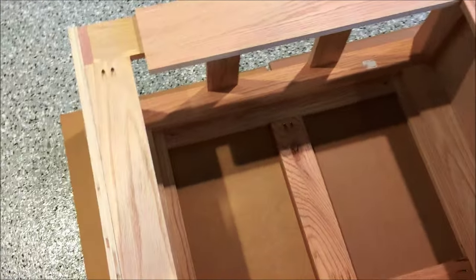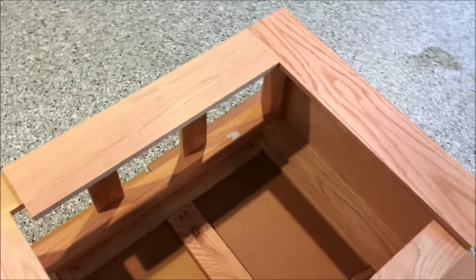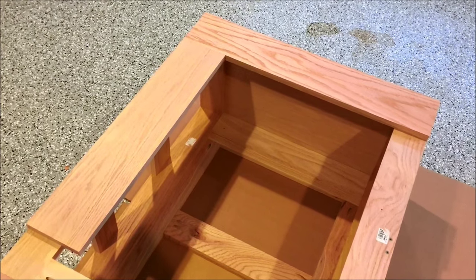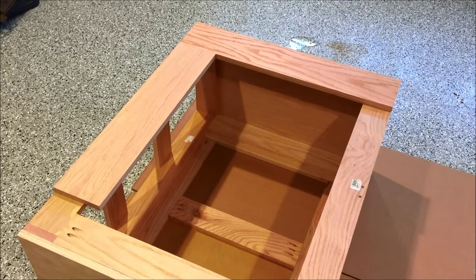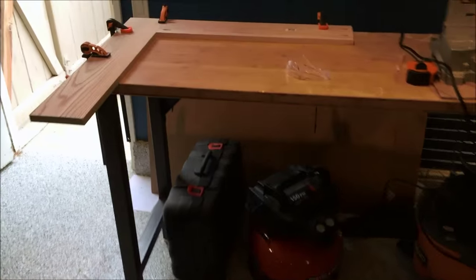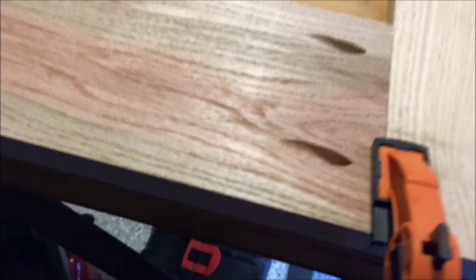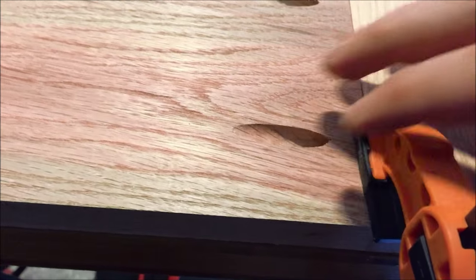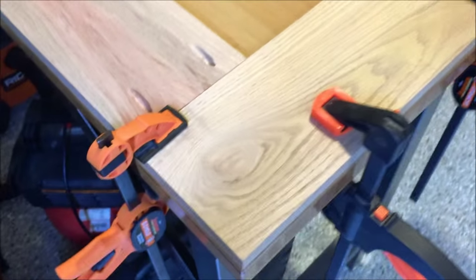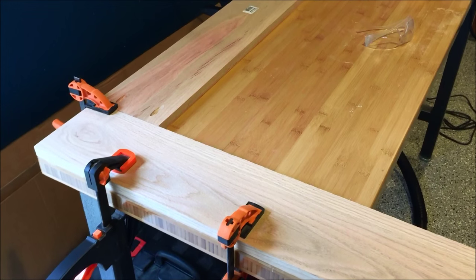One side of the stand frame is in — I used pocket holes to assemble that frame together, then glued, clamped, and nail-gunned it to the front. Now I'm going to the other side. I haven't decided which side will be front or back yet because I want to see how both come out. I have two pieces here for the frame, clamped down with the pocket hole jig. One key thing is making sure everything is completely level. Even with clamping, the boards may have a slight warp — you really can't tell until you unclamp it.